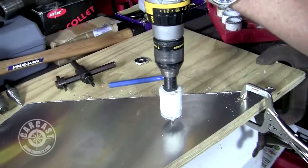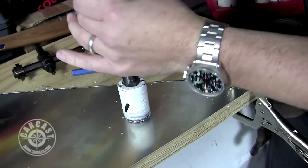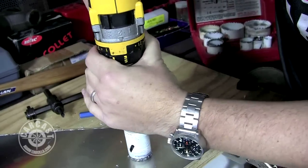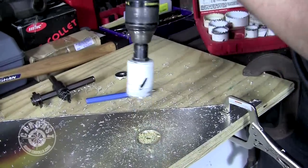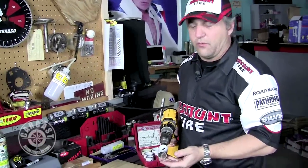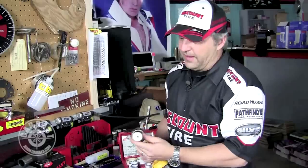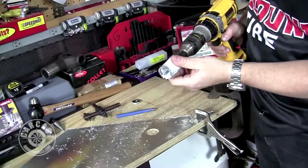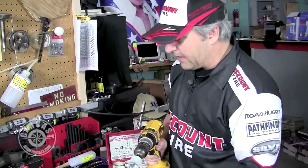Let's do a sample hole — we put a piece of plywood here so we don't drill through the workbench. Set the clutch to drill... and done. Actually not bad. One of the key things is straight-through drilling. If you're drilling harder or thicker metals, it gets worse, but these things really are the backbone of drilling large holes because they're cheap. When they go dull, you toss them. They always have the problem of how to get that little centerpiece out — you just pop it out with the drill bit. The hole it leaves is pretty nice, a little sharp burr — clean it up with a round file and you're good to go.